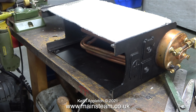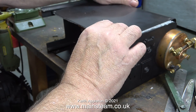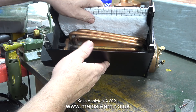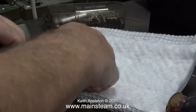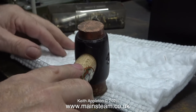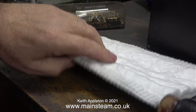And like a lot of good ideas it was very simple and easy to fit. The mesh supports the heat insulation material and once the mesh is supported by the bolts that hold the side panels in place it's going nowhere. In the past, especially with the thinner type of insulation, I've used cyanoacrylate or super glue to hold the panels in place. That method was very messy and when I first lit the burner underneath the boiler the smell was atrocious for quite a while.